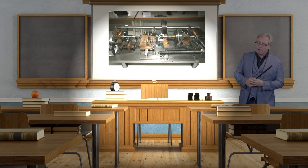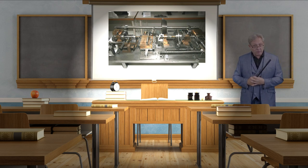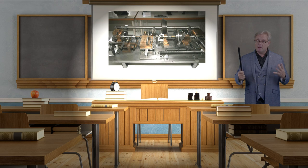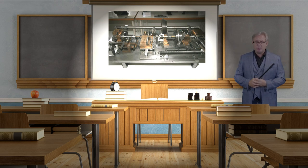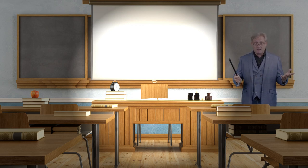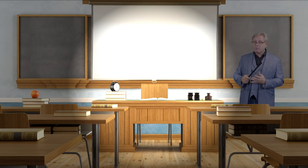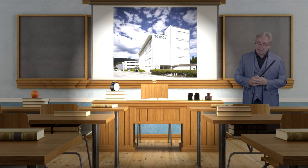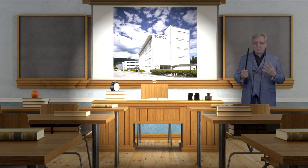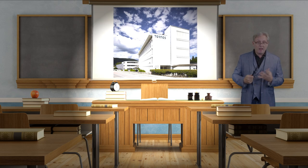The name 'plate machine' referred to the original design of all components being assembled on a steel or cast iron plate. They then adopted the Swiss moniker when the process was taken outside of Switzerland. By the mid-1880s these machines were being mass-produced by Nicholas Juncker of Juncker & Cie out of Moutier, Switzerland — which was and remains the watchmaking capital of the world. Later versions incorporated cams to automate the motion process for repeated manufacturing. Today this company is part of Tornos SA, a premier manufacturer of sliding headstock machinery, and although designs have changed and CNC controls incorporated, the core principle of a sliding headstock has not changed.